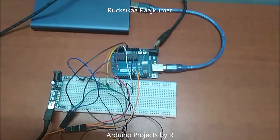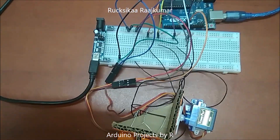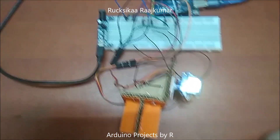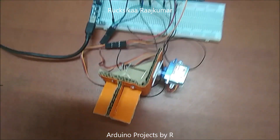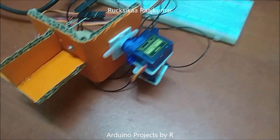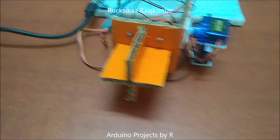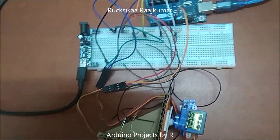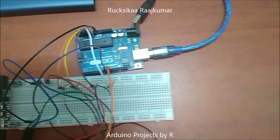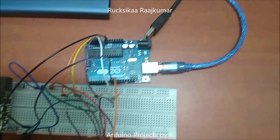For this project you will be needing an Arduino Uno, a solderless breadboard full plus, an external breadboard power supply module which can switch between 3.3V and 5V. You will be needing two Tower Pro micro servo SG90, four LDRs, a bracket to contain these four LDRs, and each LDR must be connected with a 1K ohm resistor before it is connected to the analog input ports of the Arduino Uno microcontroller board.